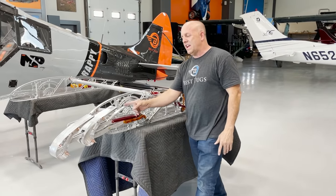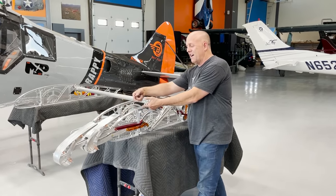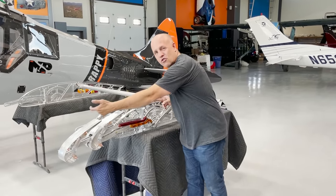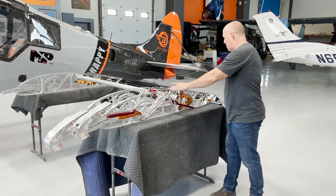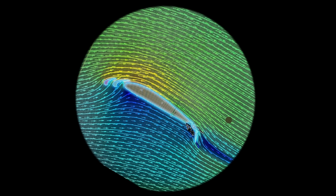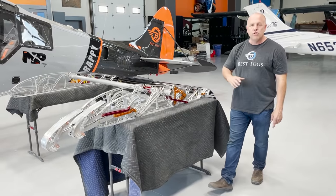But when I staged two together, I got the increased velocity on this one matching up with the increased velocity on the second. Now I have two high-speed sections of air grabbing the third slow air, and when a single slatted wing started stalling and working its way up to here, the double slatted wing carried the air faster all the way back to a 50 degree deployed flap, which just blew my mind.